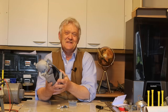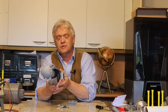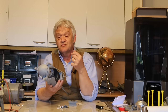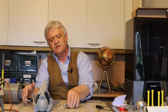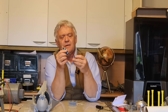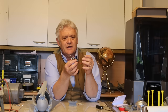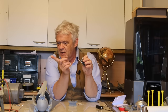That was impressive! I had an anemometer and measured the wind speed — it was between three and four meters per second. You couldn't really tell on the camera, but this thing was a blur of speed. It's not quite finished: we've rectified the current, but we do need to put it through a voltage regulator. You feed the output in and get 5.2 volts out as a nice steady current, so we can charge a phone, charge battery banks, power electronics, or keep a camera charged up.